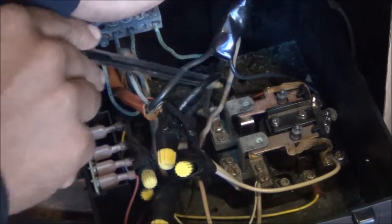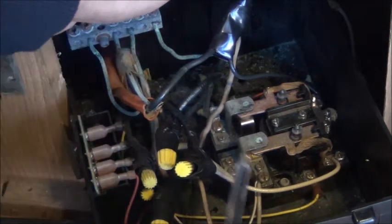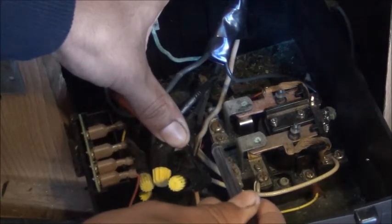And on the middle set, that'll be your inverter. Put the power coming in from the white on the right side and the black on the left. And the bottom set of screws — these right here — that'll be your outgoing power to your breaker box.